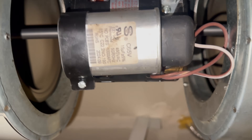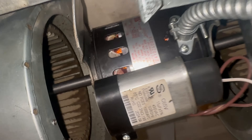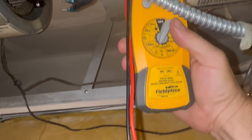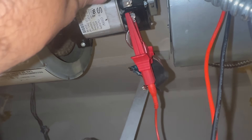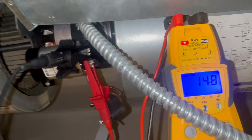Look at that — 15 UF on this lower motor. It might take that, but I highly doubt it. I'm going to use this kill switch to turn off the power. I stand corrected — it does use a 15 UF. Maybe it's weak. I'm going to set this to microfarads, MFD, to test it.